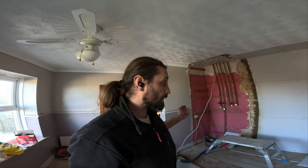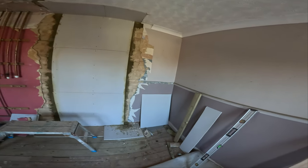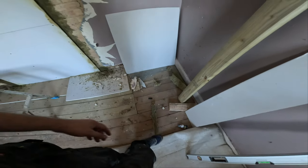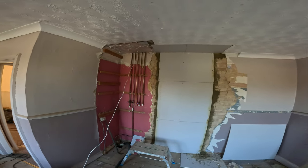All right, so I already started to do some repairs around here, and I started from the first floor. So the first floor is quite done at the moment. I just built in a stud wall, insulation inside for sound. This one right here is something from Knauf, 50 mil, and I doubled it, so we have 100 mil inside. And yeah, pretty much this one is done,